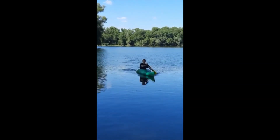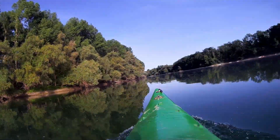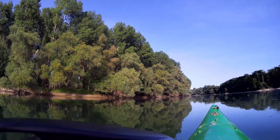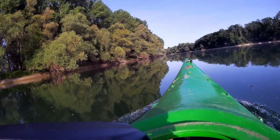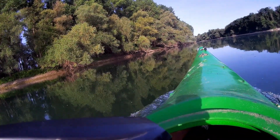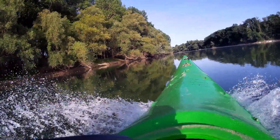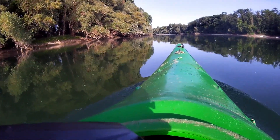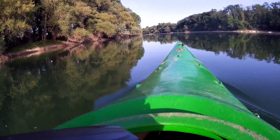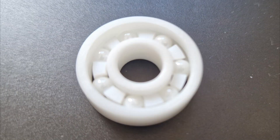I had to paddle back, but I didn't want to give up on the project right away. Instead, I reprinted the impeller — this time trying the two-bladed version with a lot more infill. I also ground down the outside diameter a bit more so it cannot contact the pump housing, which seemed to be an issue with the old impeller and was probably the reason it exploded so spectacularly.